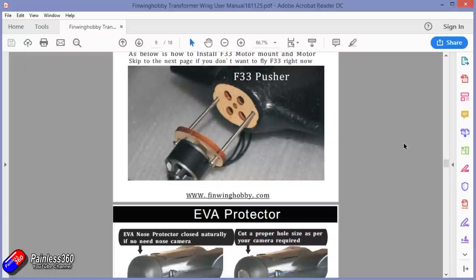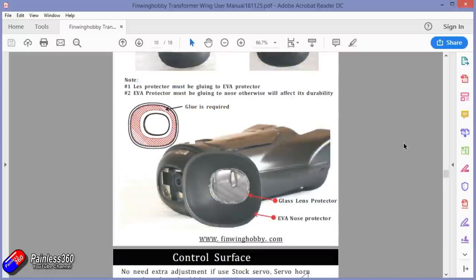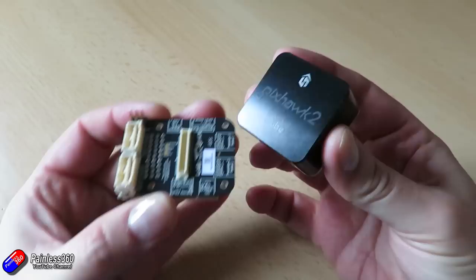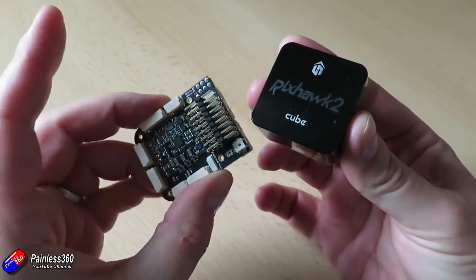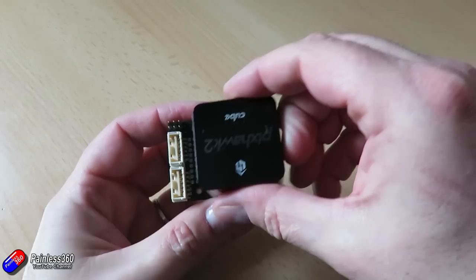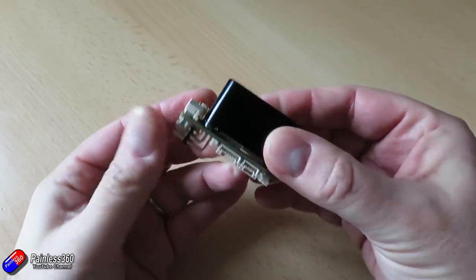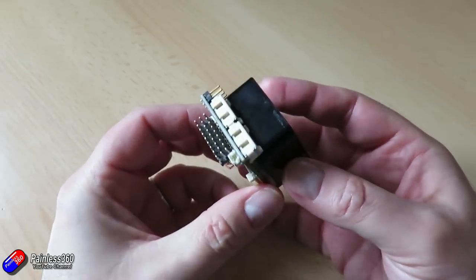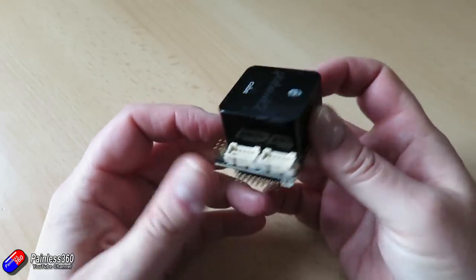You can either have two FPV cameras and switch between the two, or what I'm thinking of doing is popping a Pixhawk in this. I did the mini Eagle Tree Vector build just before Christmas, so it's probably time for me to revisit the Pixhawk and ArduPilot stuff again. Get a Pixhawk cube — I've got one that has a little attachment at the bottom rather than the big standard carrier board. Pop that in the middle and set it up to do shutter camera control so it could be used for mapping, which is something I've had a couple of questions about.